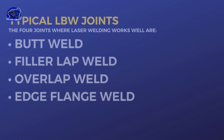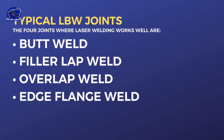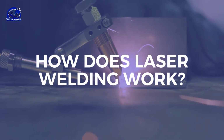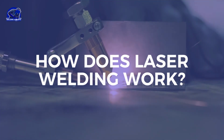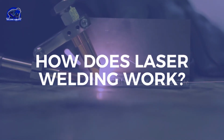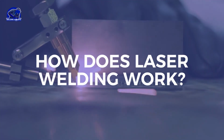Typical LBW joints. The four joints where laser welding works well are butt weld, fillet lap weld, overlap weld, and edge flange weld. How does laser welding work? By introducing a powerful laser beam into the joint, laser welding introduces heat. When the material resolidifies, it fuses the two sides of the joint. A laser and optics to focus the beam precisely on the joint are the minimum requirements, as well as a work tool to fit up the parts and hold them.